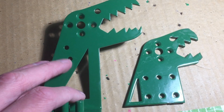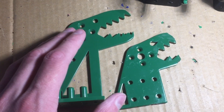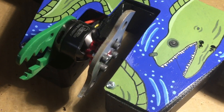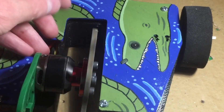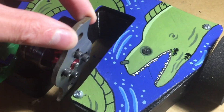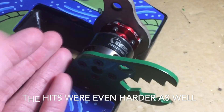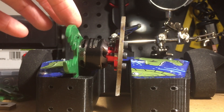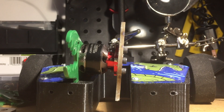Here's what the old upright used to look like and here's the new one — there's a very big difference in size. The old one was steel; the new one is aluminum, so it's even lighter. The old upright had issues bending while hitting things during testing, but I've tested out this new Moray with both the disc and the blade a few different times, and so far there's been no real noticeable bending of the upright, even though it is aluminum instead of steel. The weapon is at a bit of an angle, but that's not because the upright bent — it's just at an angle for some reason, but it shouldn't really affect the performance of the robot.